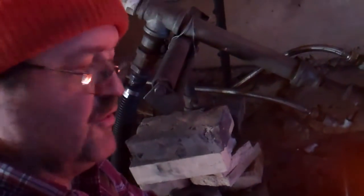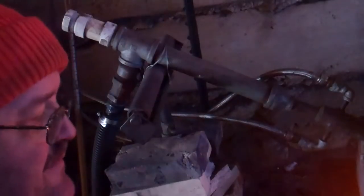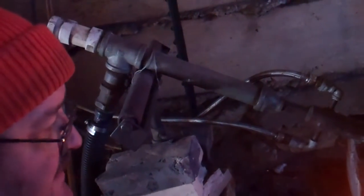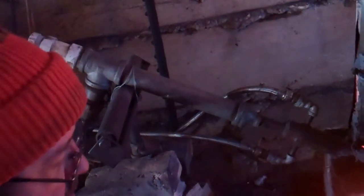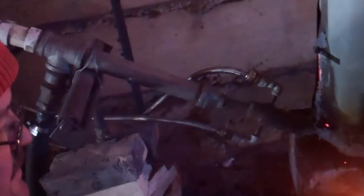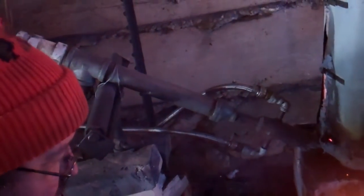Yeah, and then it's lighter, and that's why it runs off to the side and the steel stays in place. This is liquid, whereas the bloom is a solid. Oh, it's still solid. Yeah, the steel bloom, because it's not really melting to form itself. It's sticking to itself. It's sintering. Is there a point where it melts back together? Well, little corners and edges will actually melt, but that's not the primary mechanism.